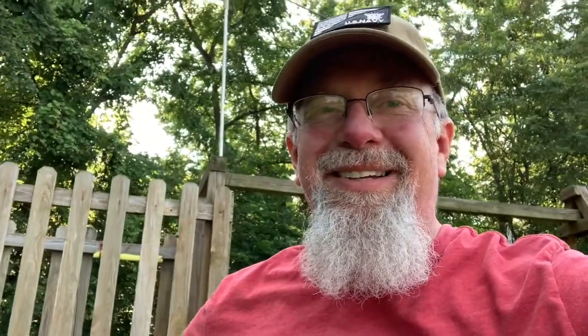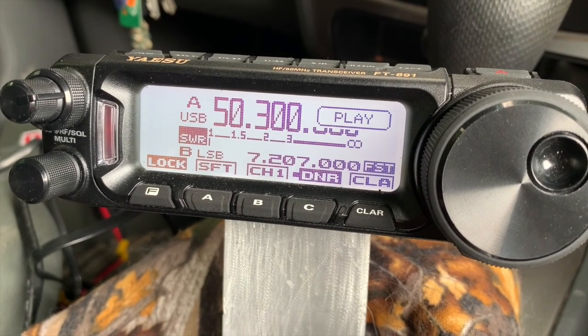So we've seen the SWR, the length, and what I used to make it — but what does it look like on the bands? How does my radio like it? Let me throw in a clip so you can hear me calling CQ for Parks on the Air and see the SWR meter on it. This literally cost me the price of that SO-239 connector — all the rest was spare wire, spare wood, the painter's pole I already had, and an umbrella we were throwing out. So go out there, make something yourself. Until later, this is KE8ONI and 73.